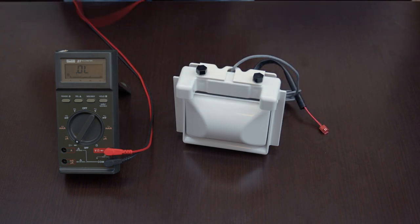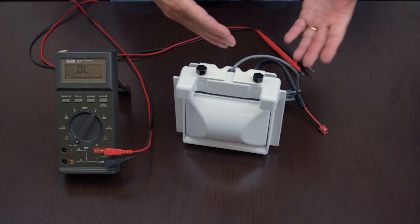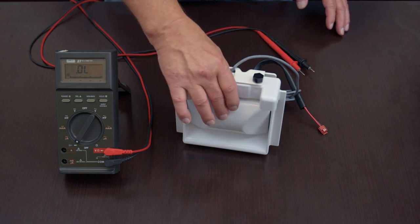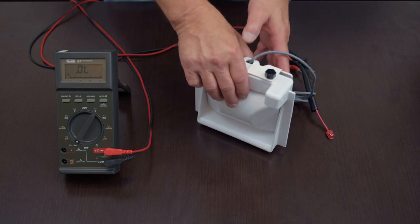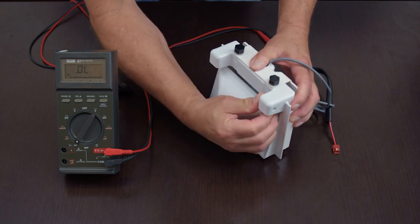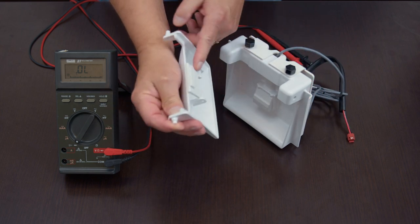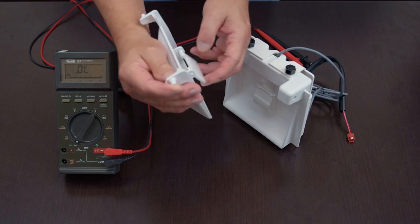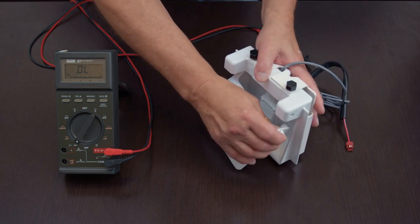If you have a bad switch, then it could be a couple of different things, a bad internal switch or lime and scale is built up and is actually holding the door and won't let the door open. In the event the door will not open, you can take it apart and clean it. It's hung with two pins, so you can take the door off and there's an internal flapper with a magnet on it. So make sure that's in the down position and your door moves in and out freely. And that would be the way you would take it apart and clean it.